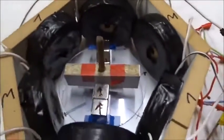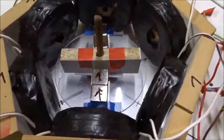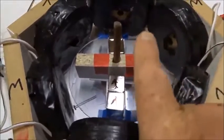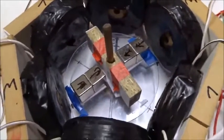However, when we go to 6 wire coils and put a series of magnets in the middle, you can have them 2 ways. You can have a single dipole, you can have 2 N's out or 2 S's out. You can do it both ways. Here we have 2 S's out, which is a good arrangement, and you can spin it up somewhat using the rotating magnetic field, UVW, UVW. It'll spin anti-clockwise. These poles will follow the field around.